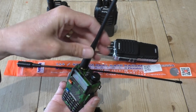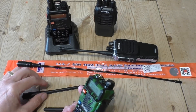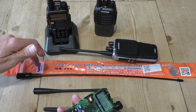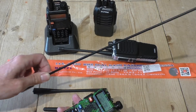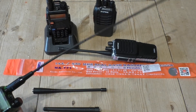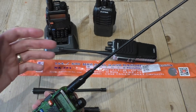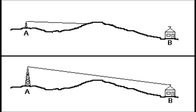Other than that, if you just use these radios for things like camping or fishing — for example keeping in contact with your mate half a mile down the bank — you're going to be absolutely fine. So why take the risk? Why not just use a standard PMR radio? Well, these are higher output, higher wattage, which means you get further distance. You can also change the antenna. I've just swapped on a cheap clone antenna — 99 pence delivered from eBay — and putting a longer antenna on the radio can increase range and reception quite dramatically.